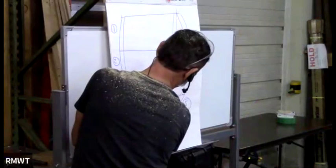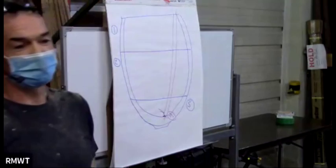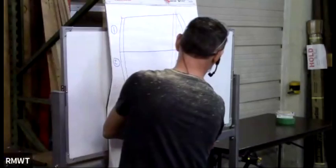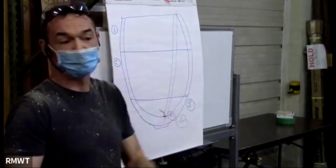And that's too high. That's about 75 degrees. So can that be cut with a gouge at 75 degrees? It cannot. The highest angle we can go to is 70. If you make your bottom bowl gouge 75, it just won't cut. So that's the time when you just use a scraper in the bottom, that last half an inch. You just can't get your gouge to make it, so you pick up a scraper and scrape it out.